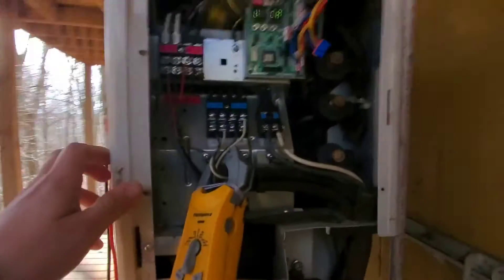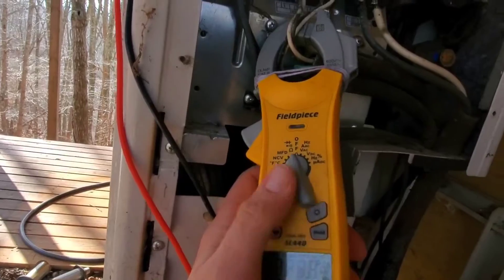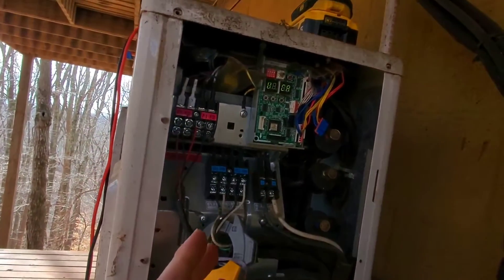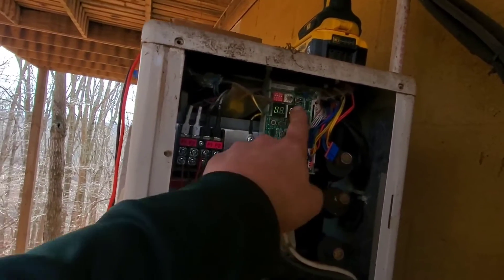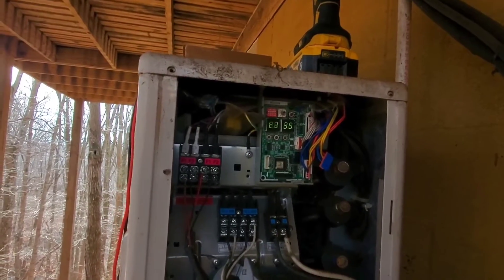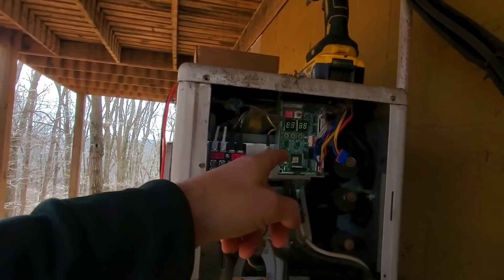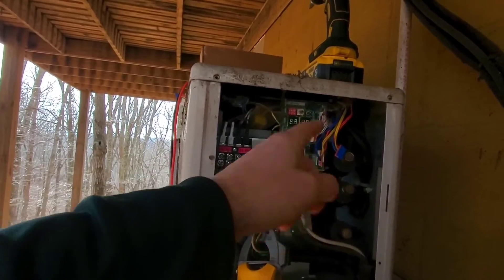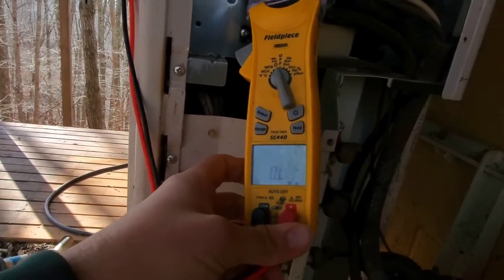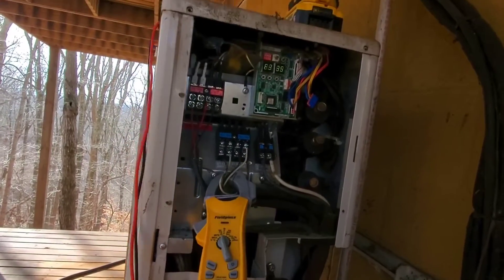On your meter you put it to ohms and you're going to measure these sensors — you're going to have a 10 kilo ohm reading. You see how we've got a 335? It says E335. That means evaporator outlet sensor open or shorted since I pulled this off. So it's already throwing an error code because I've pulled that plug loose. I'm going to ask you guys if you find anything a little unusual with the readings that you see that I get here in just a second.